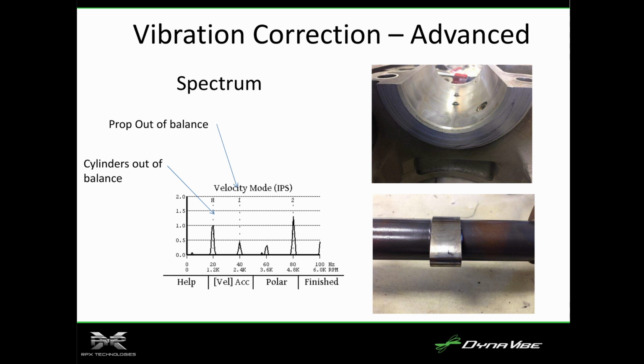We just had the engine rebuilt. A customer had put on an oil pan heater, plugged it in, and our estimate is about a month that they'd left it plugged in, and it totally wiped out the engine. So we had to have the engine torn down because of a cam failure. We had low compression on the cylinder. We look in the cylinder, it's all scratched up.